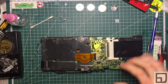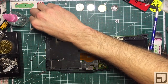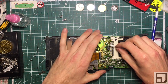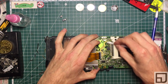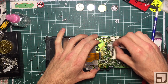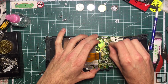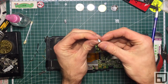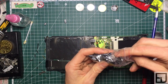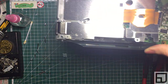Stinky — that is one leaky cap. You can see there's some gunk there. We'll clean it off and spray with alcohol. This one's kind of important because if that got into the contacts of the memory card reader, you may not be able to use your expansion cards. Just clean that crap off and make sure the contacts of the memory card slot are good and clean.